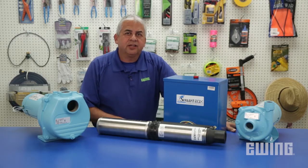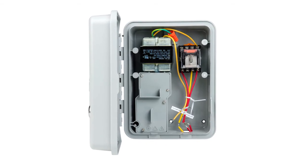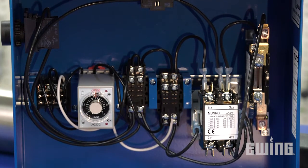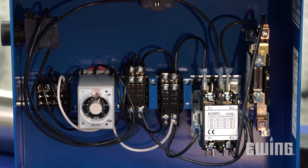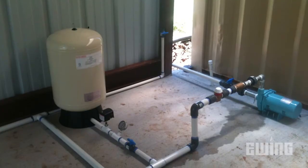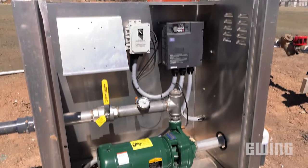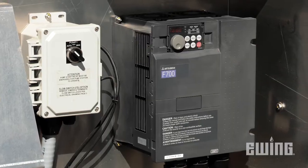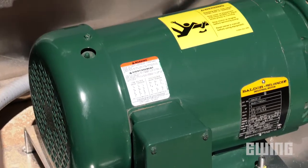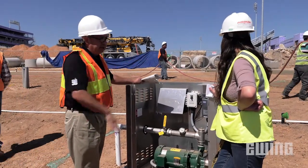Now that you have figured out which pump you need, you want to determine how to turn it on and off. Options include a simple pump start relay switch that allows the pump to be operated by the irrigation controller; a smart pump start relay which protects the pump by shutting it down if it starts to fail; a pressure switch with a pressure tank and a cycle stop valve, which allows for watering on demand, allowing the pump to operate just like a residential well system. Finally, you may want to use a variable frequency drive. This option will vary the speed of the motor to maintain constant pressure during operation and may require a three-phase pump motor. If your project is a large commercial property or a sports field, this may be the best option.